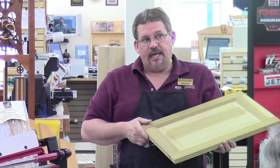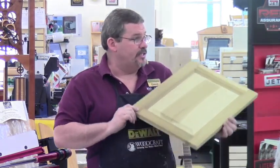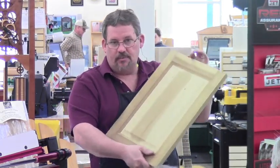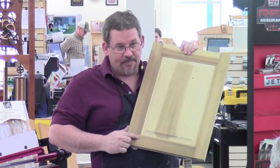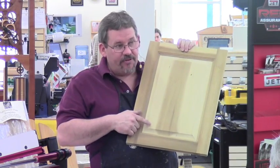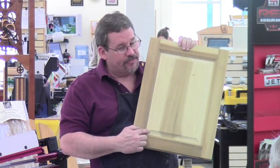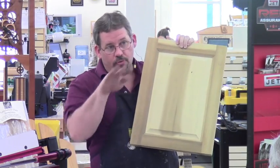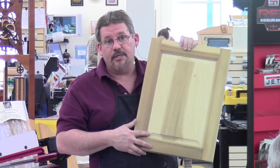That's okay, but the problem is if you want to sand this door when you're done. Even without changing the setup, this joint is perfectly flat and this one stepped up a good 64th. When you go to sand, if the panel's surface is raised above the frame surface, this crisp edge here is vulnerable to the sander. If you touch it, you'll round it right over and lose that crisp look — and there's no way out of that problem.